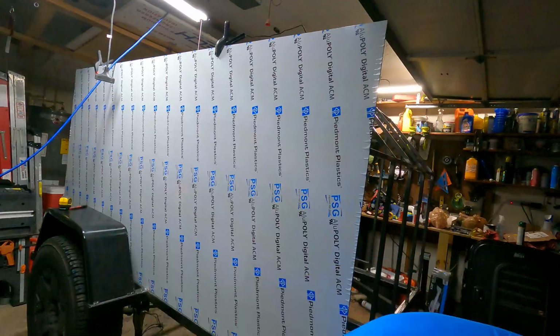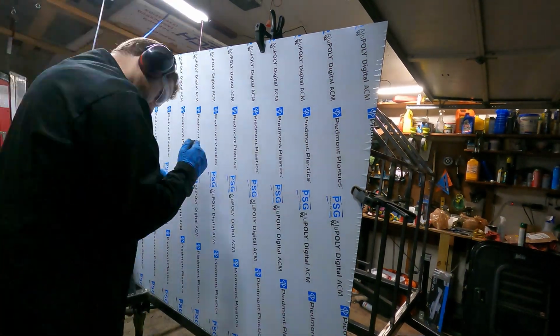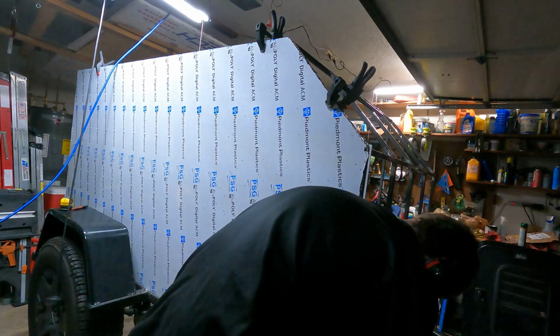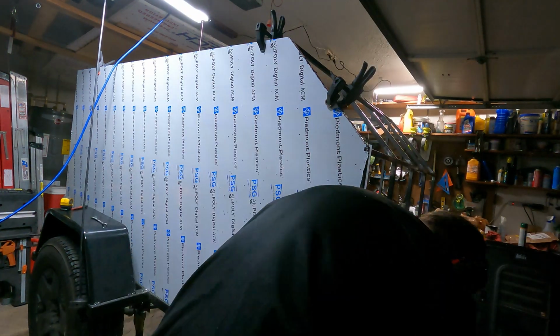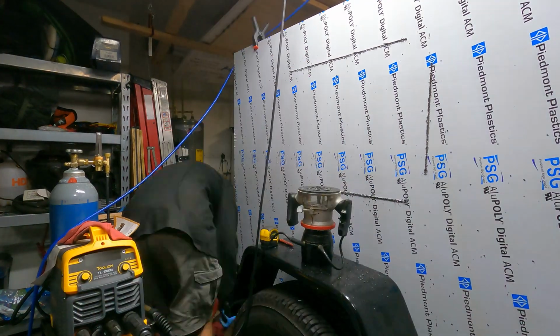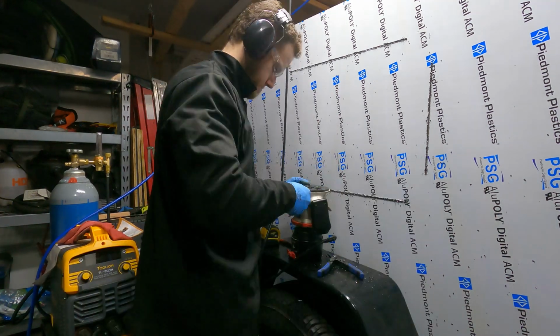And once you're done with one wall, you move on to the next, copy and paste. Now I recommend long sleeves because this aluminum throws very fine shards of aluminum and hot rubber when you're cutting through it, so I recommend you use some protection. But it's the same thing, take your router along, cut the window holes, cut the door holes, rinse and repeat.